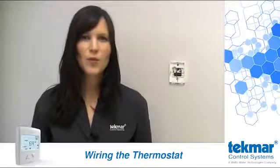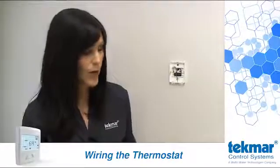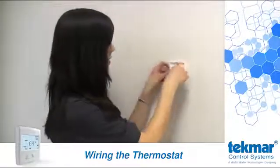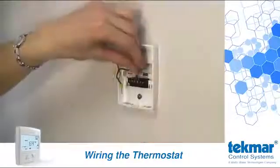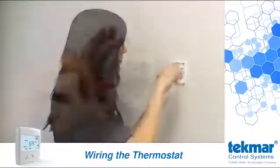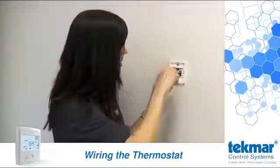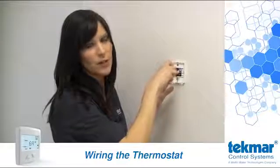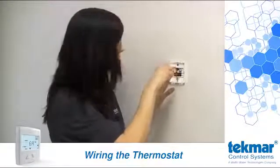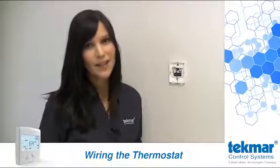As you can see I already pulled the wire through to the thermostat. We're going to start by connecting the wires to the sensor, to the transformer, and to the heat relay. Starting with the sensor wiring, I have two wires coming from my sensor which I am connecting to the S1 and the COM terminals on the 518. These connections are not polarity sensitive, so it's impossible to get it wrong. You will most likely be connecting the slab sensor 079 here, but you could also connect another auxiliary sensor like an outdoor sensor or a remote room sensor. Regardless of which sensor you choose, the 518 and the 519 will automatically detect it.